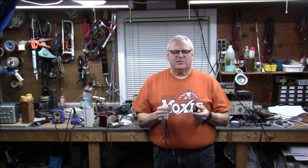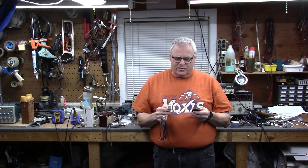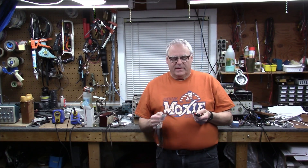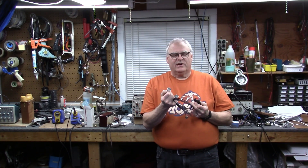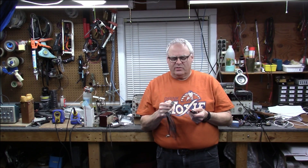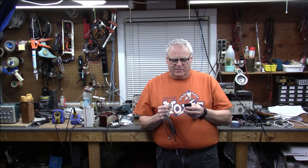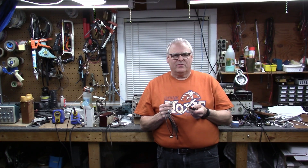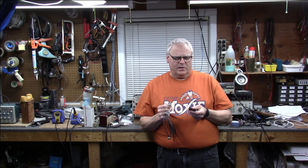It's kind of interesting. This started out 20 years ago, maybe more. I had an interest in making a point-to-point sort of communications contact using ultrasonic. I had two sensors, one in each of a small, like two-foot parabolic dishes. And several hundred feet apart, I was able to modulate the 24 kilohertz signal. And I was able to make a path a couple of hundred feet distance. If you look up the attenuation of 24 kilohertz in air, that's quite a long distance.